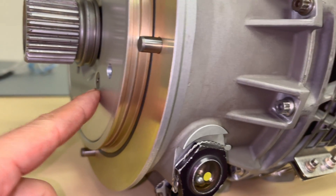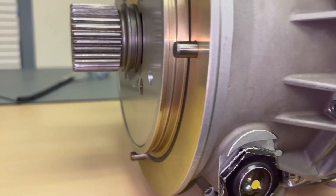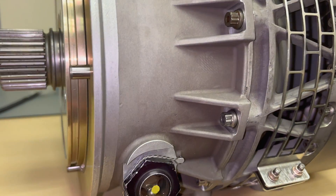The starter is filled with engine oil. You can fill it through the port here, and you can see the sight glass showing the level. The level of the starter is kept up by the oil of the engine itself — the systems are connected.